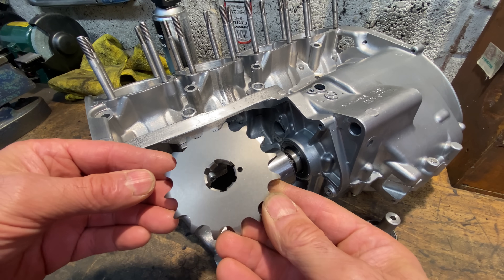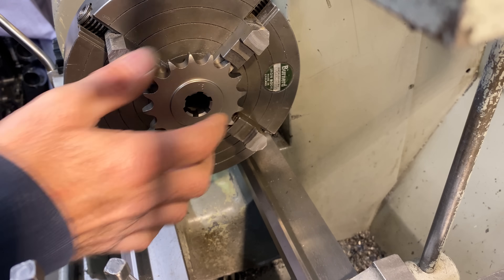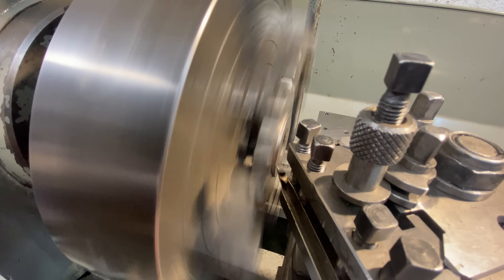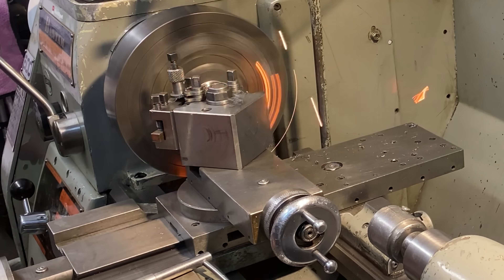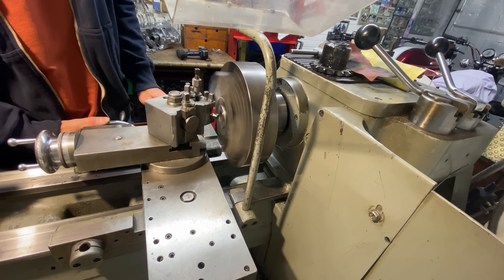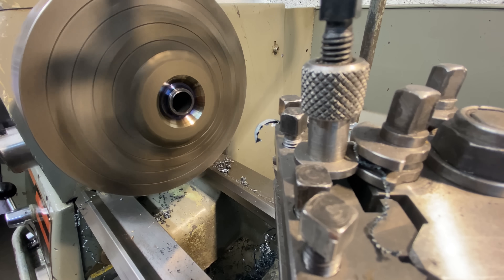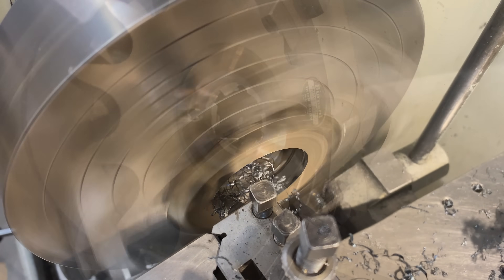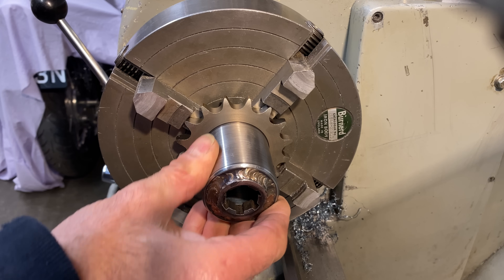So the next thing to do is bore a large hole in a new sprocket. I grip the sprocket in my four-jaw chuck on the lathe so I can true it up to the central boss. Using a carbide tool I machine away the surface — it is so hard and sparks fly everywhere. Front sprockets are made from case-hardened material so they are hard on the outside and tough in the centre. I keep machining until the central splined boss falls out, then I can bore out the hole so it's just a bit smaller than the extension shaft. And that's just perfect.